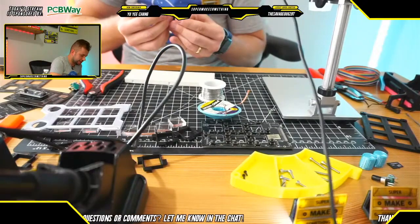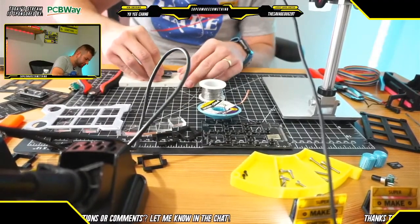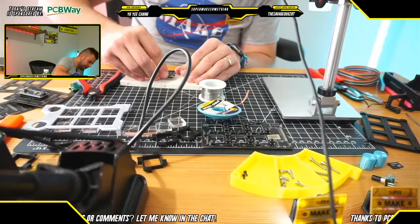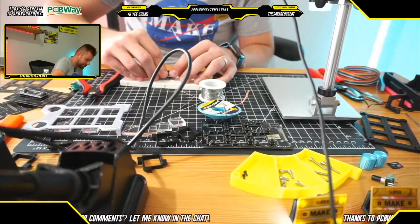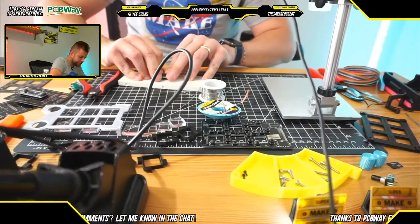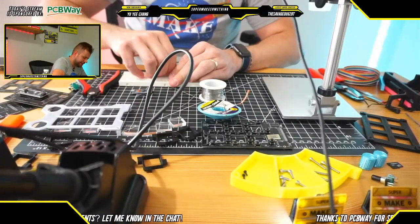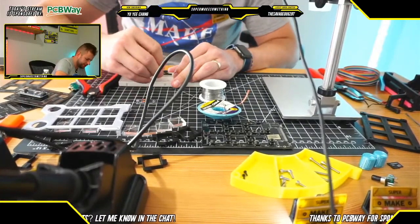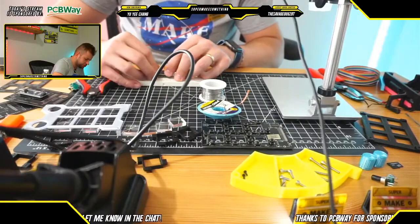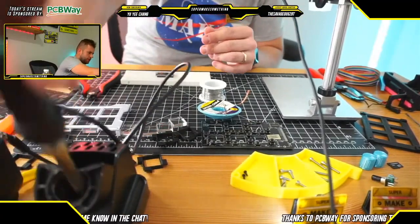All right, I see right now in the chat there is some discussion going on about using a Raspberry Pi and Python. Certainly that's one of the things that you could do, and you'd be trading off the complexity of the software that you may need to write against the power of the Stream Deck with some niceties. One thing we'll notice towards the end of the build is that one of the limitations of the Arduino is that the processor has a tough time updating the pixels of the LCD screen during every cycle, just because of the clock speed of the processor on board. What that means is that the icons refresh a little bit slowly compared to using a more powerful microcontroller, which again might not be as easy to program, or a Raspberry Pi.